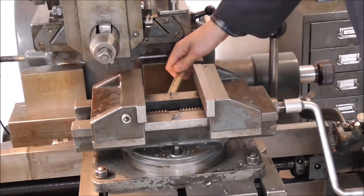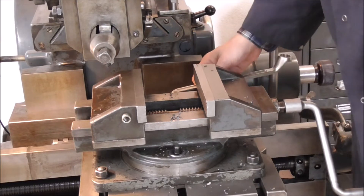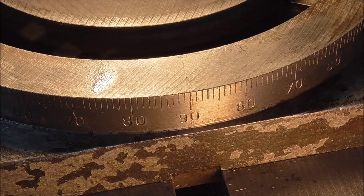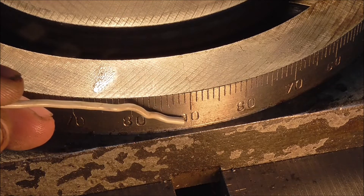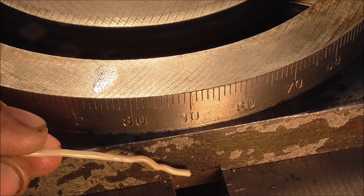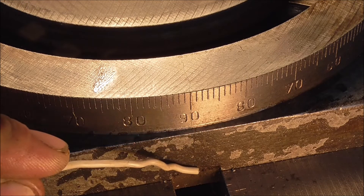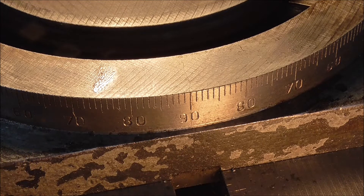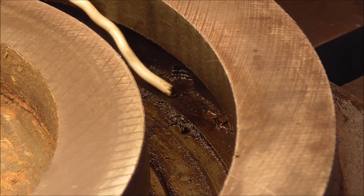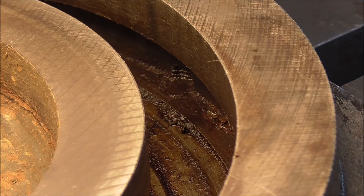So with the freshly gained confidence that I suck at welding, and never having welded cast iron before, I think we have a perfect base to now weld the crack in this thing. Can you see the crack? It promenades right through the 90 degree mark and if you look closely it even penetrates through the base here. It does the same thing on the rear, and both ends of the crack go right to a bolt hole. You can see a black shadow right in the top of the picture, and right down here is a bolt and some threads cut. That's where the crack originates and where it ends.